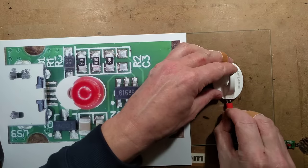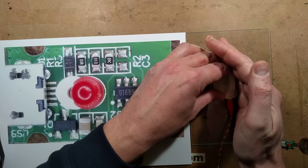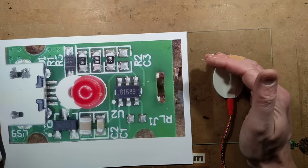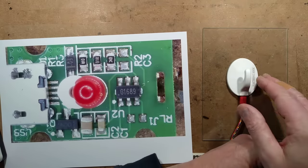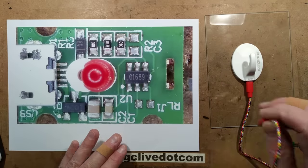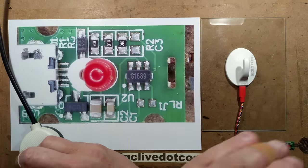I'm going to demonstrate the removal now by plugging it in. It went into cool-down mode because I applied power then changed my mind and unplugged it - it was flashing the LED to show that. I'll give it a few seconds and try again: plug in, unplug - now it's flashed, gone out, lit again, and started its 70-second time delay. The hook is heating up for longer to compensate for the heat dissipation through the surface it's stuck to.